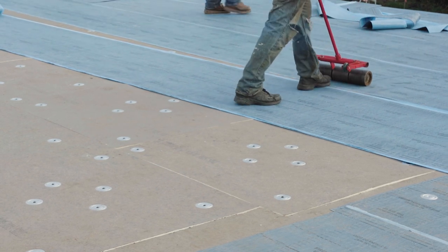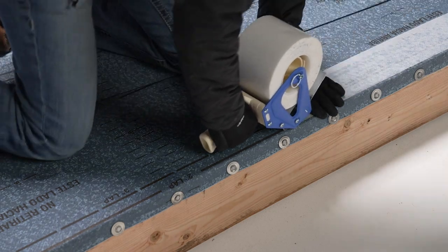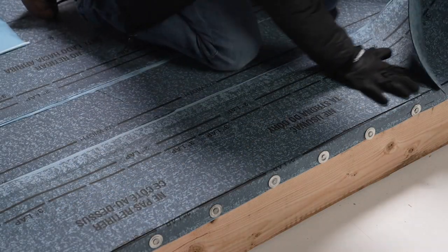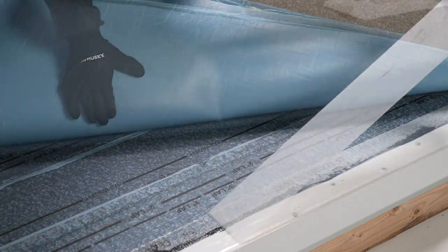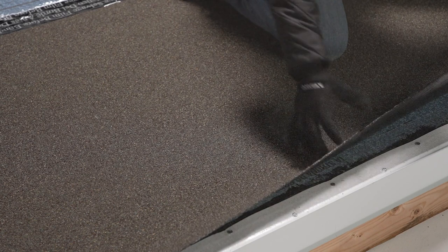Do not roll the length of the membrane. Apply the same methodology as you complete the edge metal detail, utilizing Arctic Edge to boost adhesion for the required 9-inch flashing strip, and replacing Flint Prime aerosol as metal primer on this and any metal detail, which would have extended cure times in cold weather, slowing labor productivity.